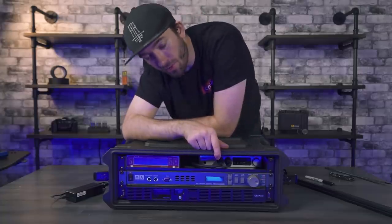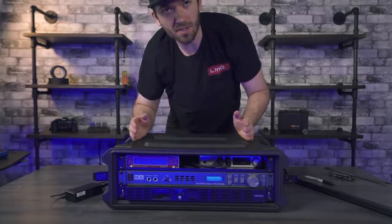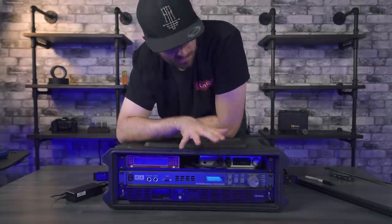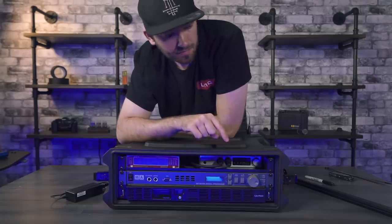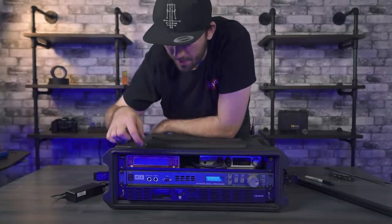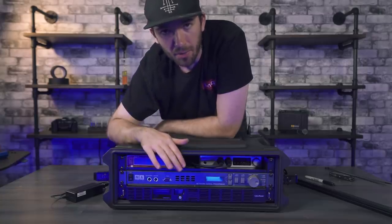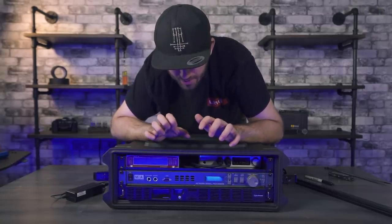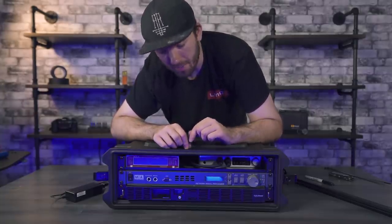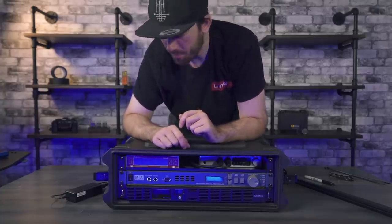the left input, left channel, whatever you want to say, on the iConnect, and then that goes to Resolume. So the computer will sit on top here and then Resolume. And that's it. As soon as that gets sent into Resolume, the signal ends there. For MA on PC, that MIF is connected via USB through that little hub that we installed in there, and the MIF is also translating that timecode slot into MIDI. But we still need one more timecode slot for MA.